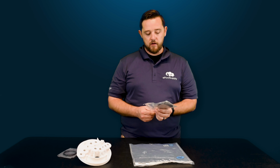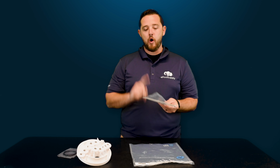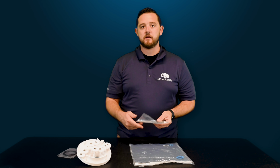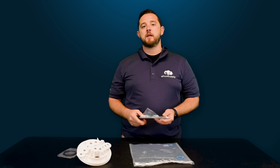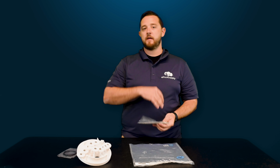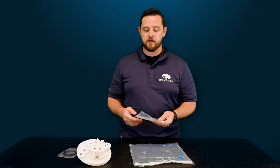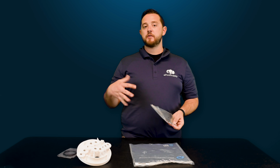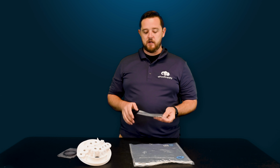And then, like all of their other ones, they are going to give you a new center shaft. Always replace this every time you're replacing the gear kit. It makes sure that everything works like brand new, and you're not trying to fight an older shaft with newer products, because sometimes over time the plastic will wear down the stainless and actually get ridges on it. So to make sure everything operates efficiently, go ahead and install this at the same time.